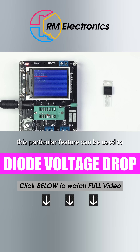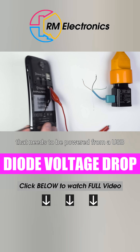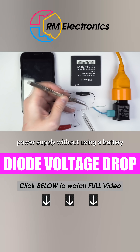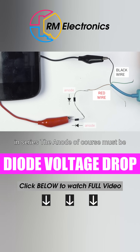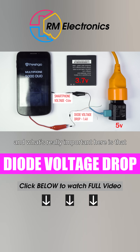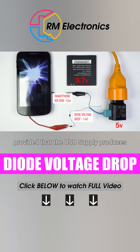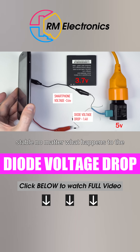This particular feature can be used to build a simple step-down circuit. Let's say you have an old mobile phone that needs to be powered from a USB power supply without using a battery. The nominal voltage of a lithium-ion battery is approximately 3.7 volts, while the USB supply outputs 5 volts. If we take two diodes and connect them in series — the anode of course must be connected to the positive rail, that is the red USB wire — we will get a voltage drop of about 1.4 volts, which is basically what we need. And what's really important here is that, provided that the USB supply produces exactly 5 volts, the voltage at the output of our circuit will also remain stable, no matter what happens to the load, the phone.